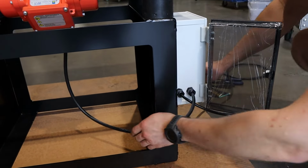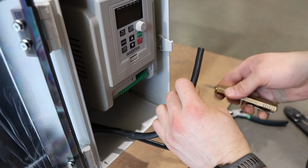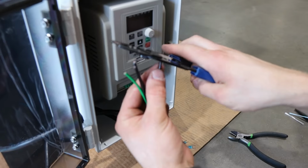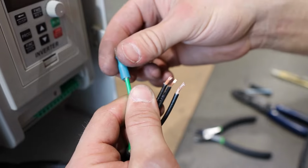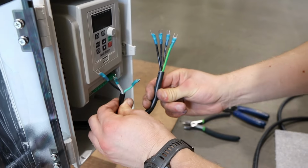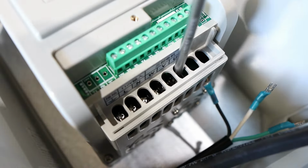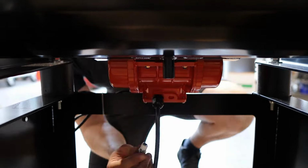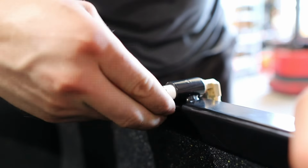Now we're going to wire the tumbler motor to the VFD. Again, it's hard to film, so I would consult the drawings and the pictures. Drill a quarter-inch hole through the UHMW tub to allow it to drain. Then attach your quarter-inch MPT drain barbed fitting and also your two 90-degree quarter-inch MPT barbed fittings into the bung on the UHMW hold down.